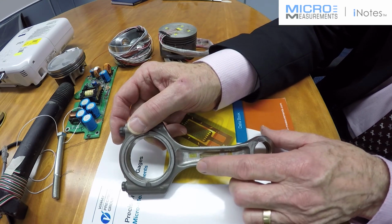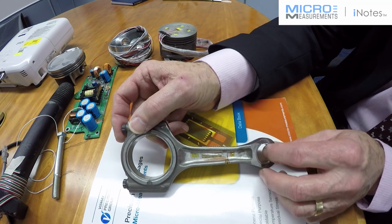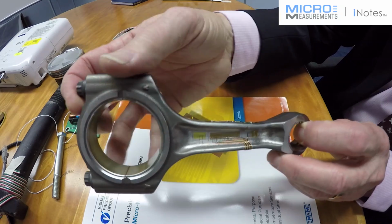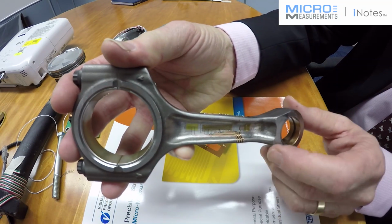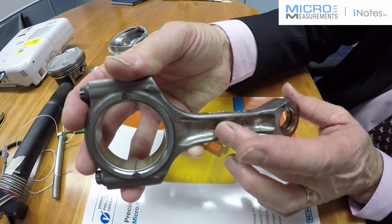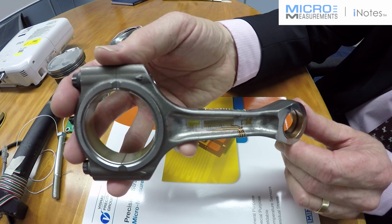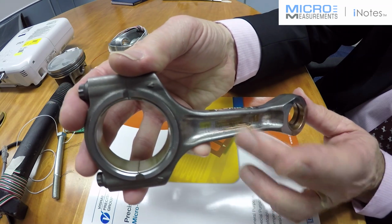They're going to see what the actual tension and compression is here during service as well. So what we did here is we put the strip gauge on here, wired as 10 individual gauges, connected them into a data acquisition system, and from there, when the con rod was loaded, we noticed that there was bending along here, and you could see over what distance the bending was actually occurring.